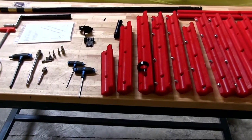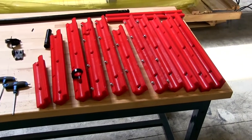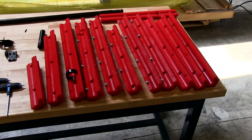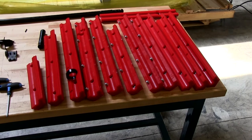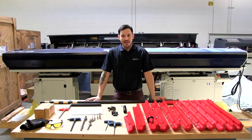We will be using a 32 millimeter guide channel set and a standard length bar pusher for this installation. The guide channel set contains upper and lower channels, pre-feed pusher, support bracket, rotating tip, and bar pusher. Now that we have our tools and channel set, let's begin.